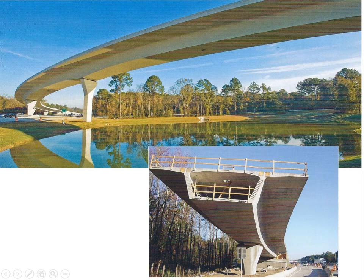Here's another example. Here we have a curved bridge. It wants to rotate over. And to prevent that from happening, it's been rendered as a tube. In this case, they've pulled the tube inward to give this bridge a nice thin edge, so it has a really elegant sweeping kind of quality to it. But this closure is really crucial to the way this beam is performing.